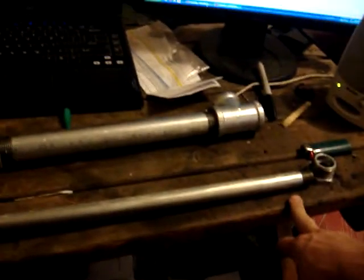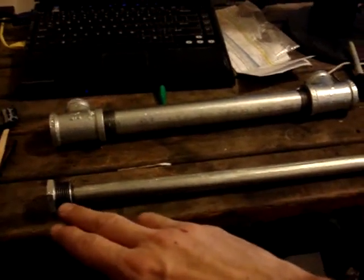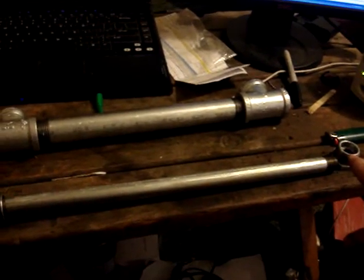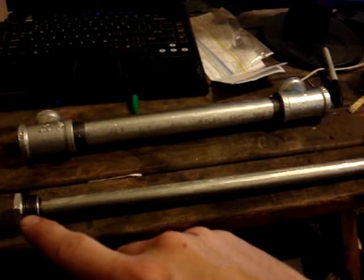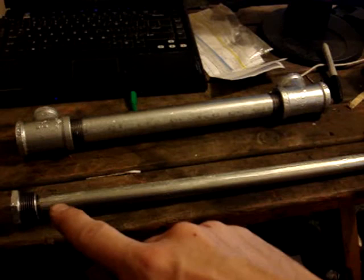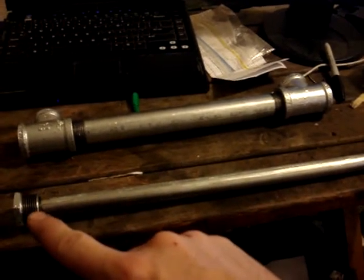This right here is a lot harder to put together than the outside one is because it's got a couple of unique parts to it. This over here has to be threaded in backwards. The way they have it from the factory is with a taper, so you can't just buy these end pieces — they're called hex bushings — at the store and just thread this half inch nipple right in because it won't work. You have to turn them around backwards and use a tap.